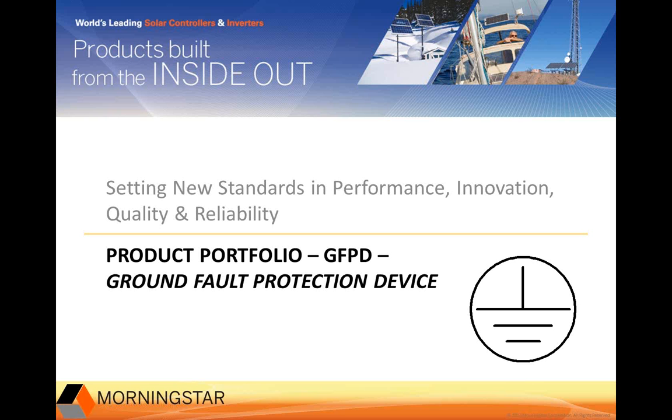In the U.S., a ground fault protection device is required by the NEC for PV array applications on residential buildings. To others in other parts of the world, this product serves as a protection device against fire and, to some extent, electric shock. We offer this protection for the 150-volt and the 600-volt versions of our family of charge controllers, and our GFPD can also be coupled with non-Morningstar charge controllers.